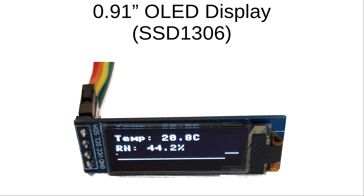One thing to be aware of with these displays is they are made of individual organic LEDs, which will deteriorate when used over a long period of time — around a thousand hours — so they may not be the best choice for displays that will be constantly switched on. These have an I2C interface needing just four connections to the microcontroller, usually clearly marked on the PCB. Like the temperature sensor, these have a fixed I2C address, in this case 0x3C. This is quite frustrating as having multiple displays on a single I2C bus would require some kind of enable circuit on the I2C signals.